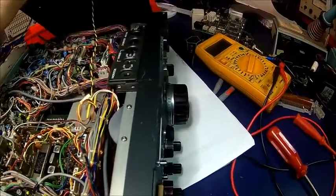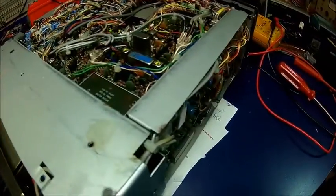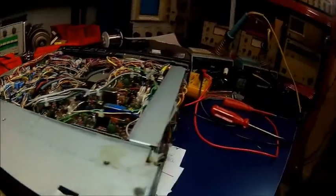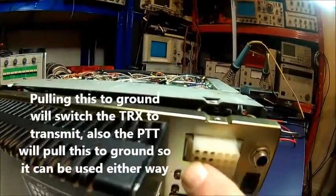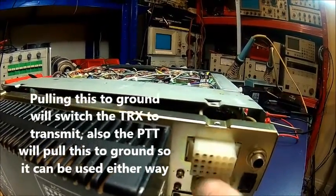Get the top cover off, get the bottom cover off. There are a bunch of screws around the sides and at the bottom as well, and then you can pull the rear unit away. Be careful — the wires are pretty short. What actually happened is there is a connector inside, and if you look very closely you can see it's not plugged in. Someone messed around with some other wires, but that's all. That's the auxiliary connector, and the second row leftmost pin is the PTT output for the PA.